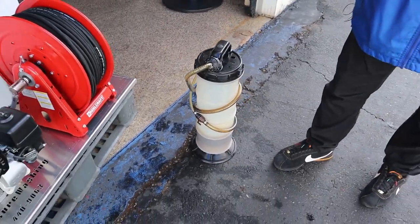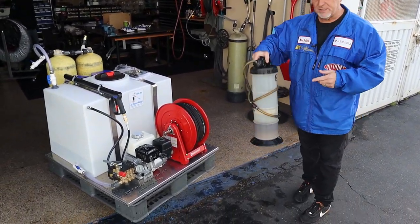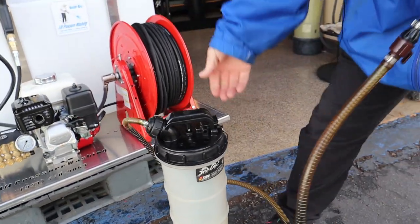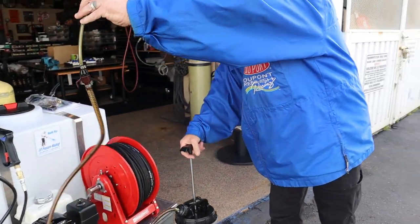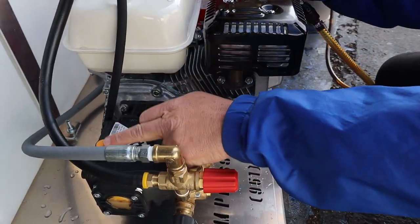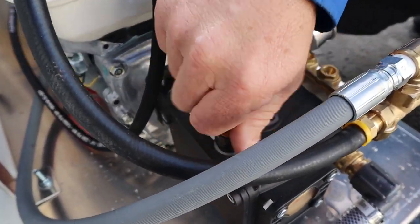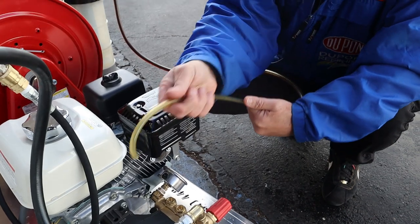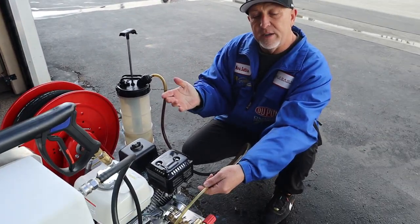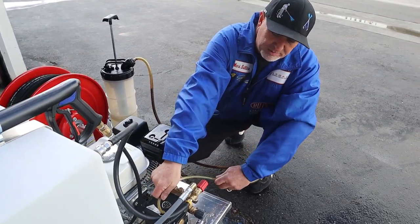What is this? This is your oil extractor — everybody wants to know how to change their oil. I go on Amazon and order an oil extractor; it's like a bicycle pump. When you pull your hose out and coil it, you've got a little handle. This hose is your inlet fill for your engine and your inlet fill for your pump. You unscrew the cap right here, stick your hose down in there, pump it, and it sucks the oil right out. It makes it nice and clean and you don't make a mess.